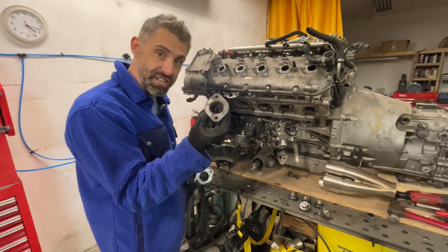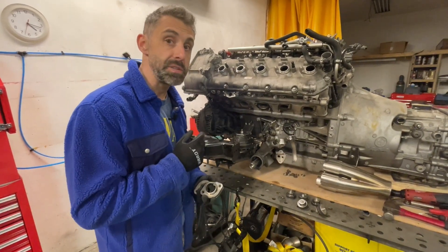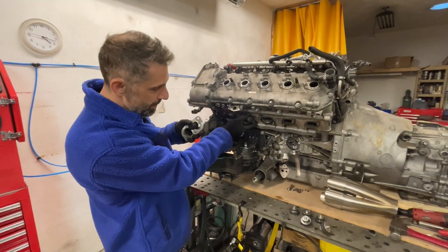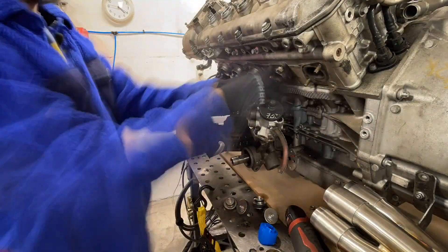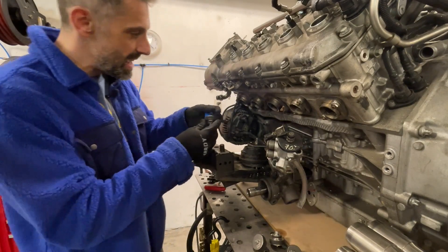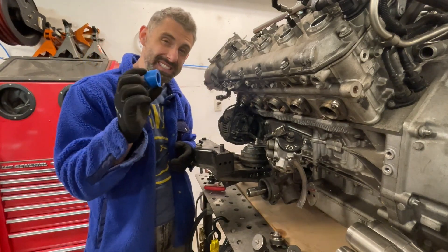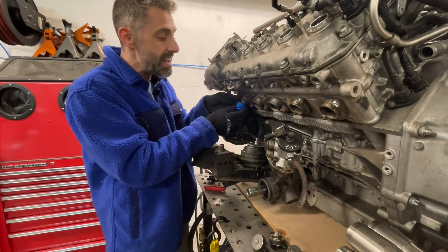I created the flanges from the ArcDroid, cut at a quarter-inch stainless steel. I also used the 1 and 5/8 primary steel from JMD Tubes and welded the start of the tube in there just to get the flanges set. These flanges are going to end up getting installed like that on all of the outlets. One of the really cool things about the Ice Engine Works kit is it comes with these little rubber expanding grommets that fit right inside the 1 and 5/8 tubing and adapt it to the blue block.